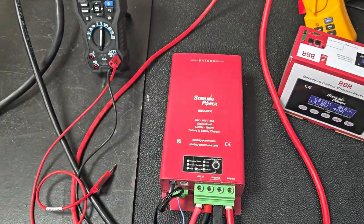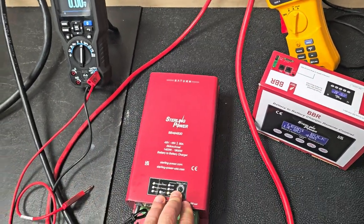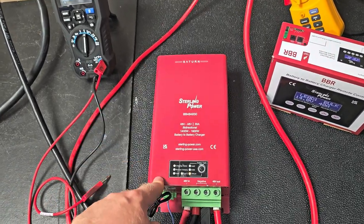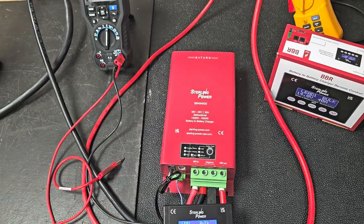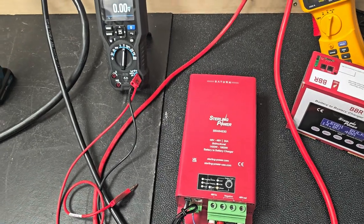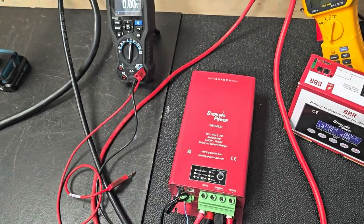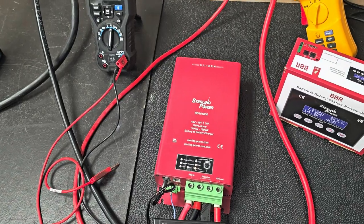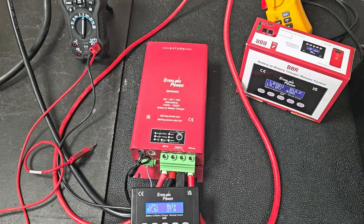This still has the reverse charging feature, so if you want to take juice out of one battery and put it into another, you can activate the reverse charge — the jump start assist, all that sort of thing. The main use of this charger will be for those that want to go from a slightly higher voltage battery down to a much lower 48V battery, or the other way around where they've got a 48.0V 15-string battery they want to boost-charge up to a 16-string lithium iron phosphate battery.